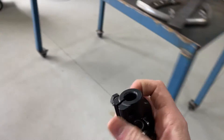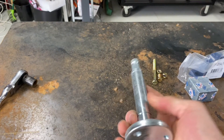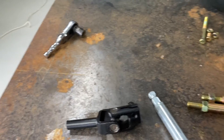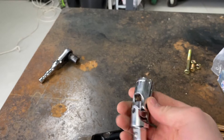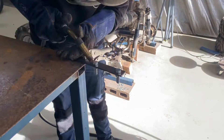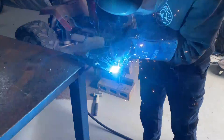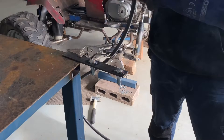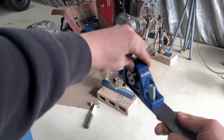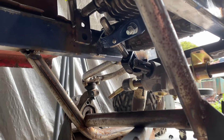These seem to be a special 30-spline shaft. I wouldn't have cut that off if I didn't need it - I had this laying around with a steering wheel and wanted to utilize it. For now that lower joint we'll replace with a standard universal joint - I'll buy one off eBay because they're pretty inexpensive; the stores wanted about 80 bucks for one. I've put as much angle on that joint as I want and we're just clearing the engine - pretty damn tight.